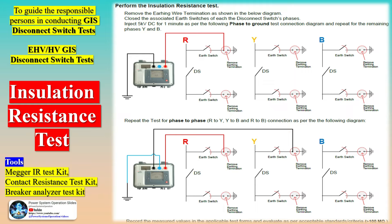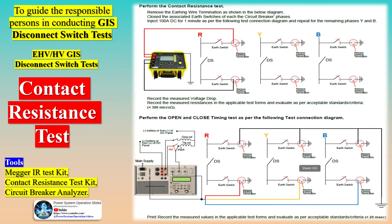In addition, the checklist addresses crucial factors related to the overall functionality and labeling of the substation. It stresses the correct installation and labeling of front panel devices, operating devices, and phase marking. It also underscores the importance of visually verifying disconnect switch and grounding switch positions, installing dispatch numbers, and marking gas density gauges in each zone.